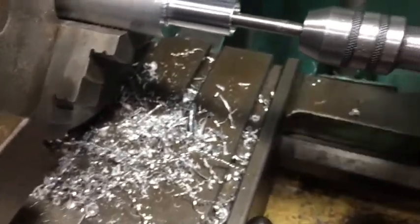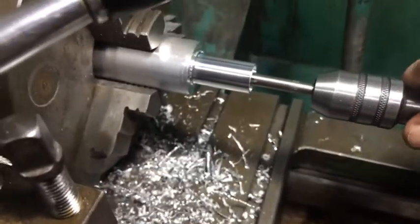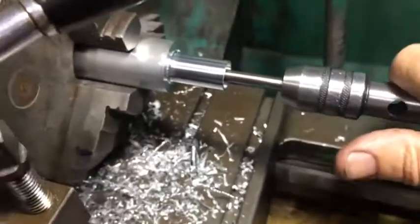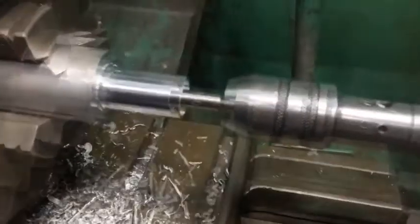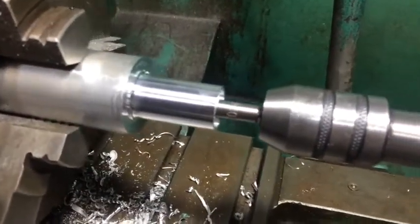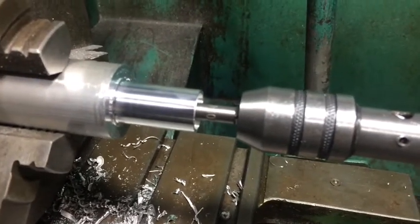Being aluminium it's always easier. Take it back a little bit, get it to a turn, get the crap out of it. There, we're all the way in. Once you get your tap started, it'll go in straight. You don't have to keep advancing once you get the first couple of turns - that's the angle your bit will go in. So you have to get it straight to start.